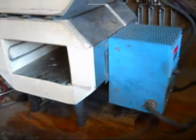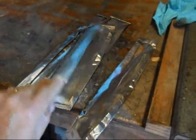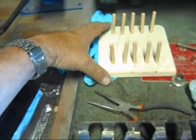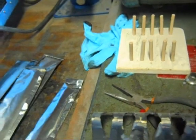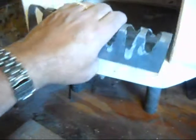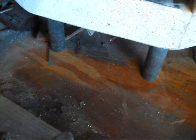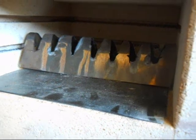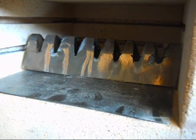I don't really need to soak the steel at temperature, but it's going to take me a while since I heat six blades at a time to cool them off. I've got two different racks — a ceramic rack made out of fire brick, and a piece of stainless plate that I folded and cut some slots in, the cheap man's knife holder. When you're sticking something in there, you don't want your blade to touch the coils — you'll short it out. That's a bad thing.